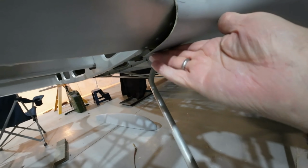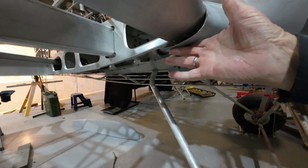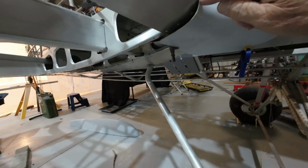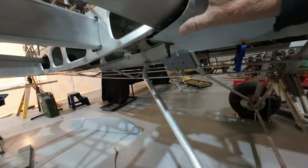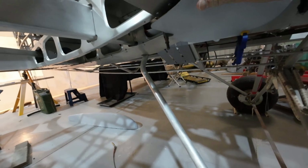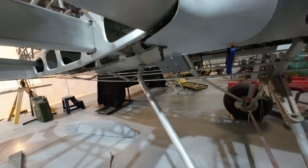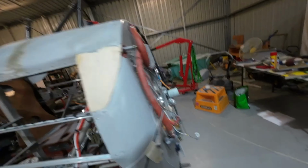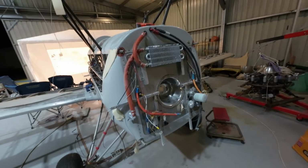Bring the bottom up to it until it touches the underside of the leading edge there, and then join the two back together again. So I'll cut a piece out of here and reduce that down and rejoin that piece. That needs to be done on both sides. So that's it